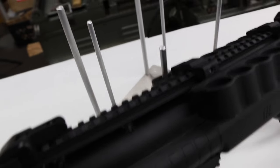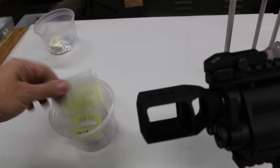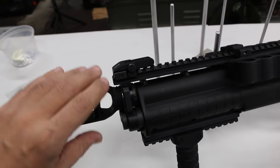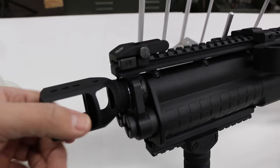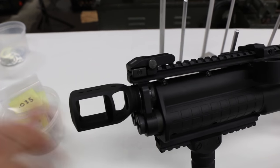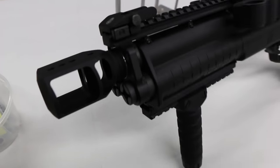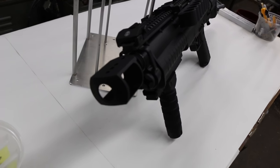We give you a bunch of different spacers — 18 thousandths of an inch, 20 thousandths, 35 thousandths — an assortment of spacers, crush washers. What you do is when you're winding this up for the first time, see where it lines up, then back it off and get a shim, stick it in from the side. Test fit it and see roughly what it comes close to. Back it out, put the correct spacers in, close it down, tighten it until the lines up completely flat, nice and tight. We went through 40 rounds with this muzzle brake with no loctite and it did not come loose.